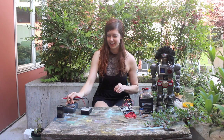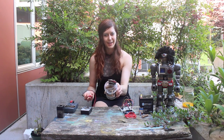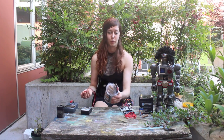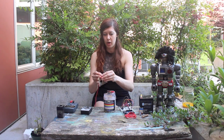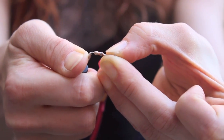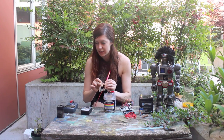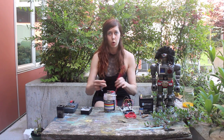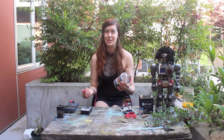I really love the resistance setting as well because, as you can probably see, this is my super messy, completely unorganized container of resistors. But it's fine because if I find a resistor, I can pull it out and check the resistance value with my multimeter since I don't have the resistance bands memorized. This says it's 9.6 kilo ohms, so about 10 kilo ohms — a really quick way to check resistor values.